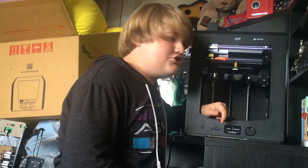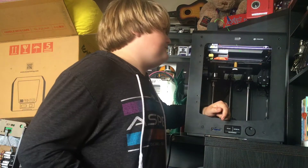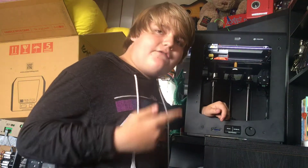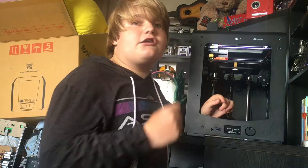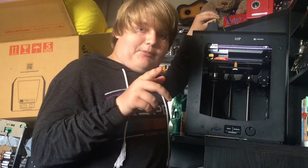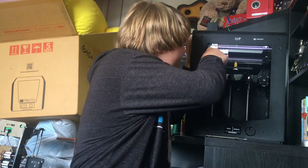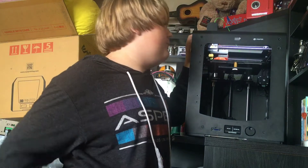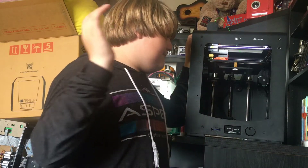The nozzle is actually a MK11 nozzle, which is really good. You might be wondering how much it clogs — MK extruders do have a tendency to clog — but I haven't had a clog on it yet. I've loaded some cheap Hobby King filament, review coming soon. The 3D Printing Professor also pointed out that this printer is very easy to unclog: there are two little screws, you take off the nozzle and clean out the filament. Haven't had a jam yet but I think one might be coming soon.